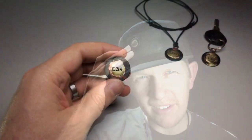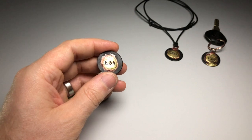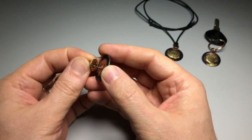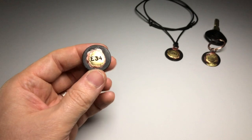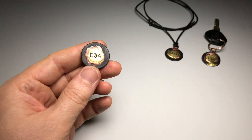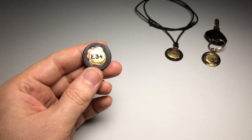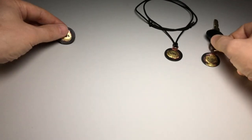I'm Brian Carlson, and this is an E34 badge. I'd like to introduce to you three versions of the E34 badge, on a mild steel body in a military style back. Each badge has been welded over fire brick with extreme heat with an oxy-acetylene torch and then quenched to get a really black contrasting finish. The E34 stamped in there has been dyed black within the inlet.